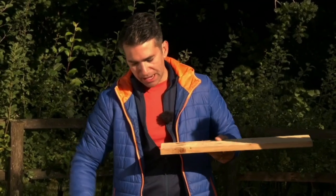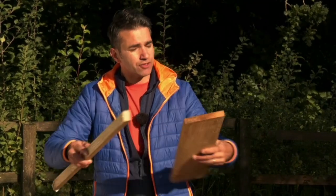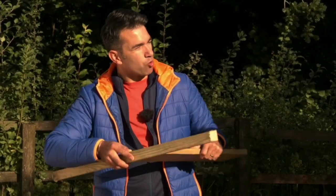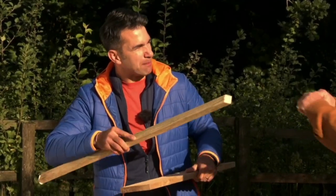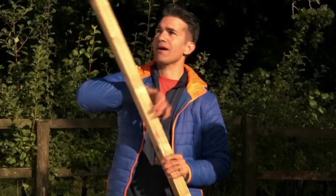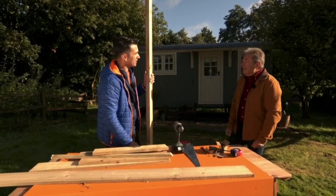A little top tip: I'm using some batten here. When you join timbers together for the top of the table, it helps support them, holds them all together, and stops any warping. By creating a little lip and trim — always put a rim around the edge — it stops things falling off, which is quite nice. For the upstand and the legs, I'm going to be using this 2x2 timber. It's still external timber. When you go into the timber yard, they still understand what 2x2 means. I'll be showing you how to angle the legs at the bottom for support.